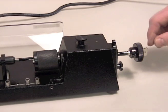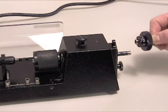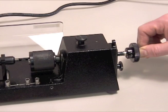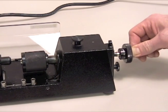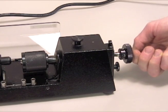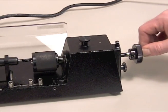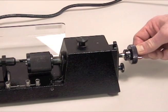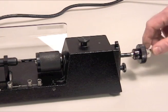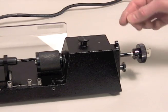The Duplicode has an internal mechanism that controls the spacing. It is set for spacing on standard 7-pin keys at 45 degrees. There are also stops at 22.5 degrees to accommodate offset cuts. Use the position knob when cutting by code. Used in conjunction with the standard spacing presets on the machine, it assures the spaces on the new key will be accurate. Some specialty keys may use a different spacing pattern. These keys can still be cut on the Duplicode.